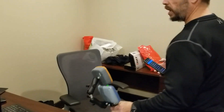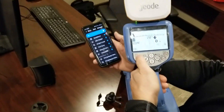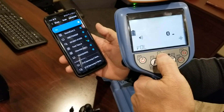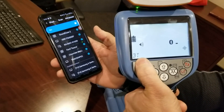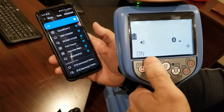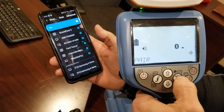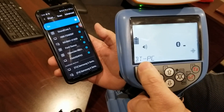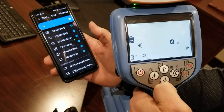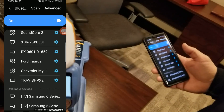Now we're going to pair with the locator on the locator itself. You turn the locator on and hit the on/off key once real quick and it will take you into the menu. First thing on the menu is volume. I'm going to scroll through the menu with the up/down arrows and scroll down to the BT option — that stands for Bluetooth. I'm going to go into that by hitting the right arrow, then scroll through the Bluetooth menu until we get to pair. I'll hit the right arrow, which is also your peak null button, and pair it to a PC. Once I see BT/PC, I'll hit the left arrow — also your frequency button — and you'll see the Bluetooth icon start to flash, meaning it's in pairing mode and ready to pair.